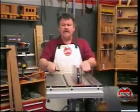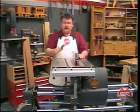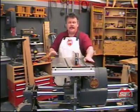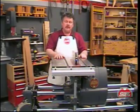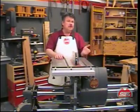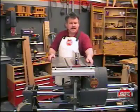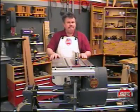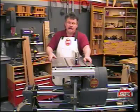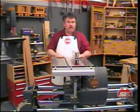When you're using the Mark V in the table saw mode for cutting or dadoing, you'll notice that the table has a little wiggle to it. It's mounted on two posts and we have to do that in order to be able to tilt the table through a full 135 degrees so you can use the machine both horizontally and vertically. But because it's just on two posts, you have that wiggle — and as you can see right now, it's a great deal more than just a few thousandths of an inch. We need to take that out before we can do really accurate work.